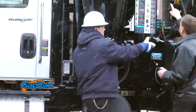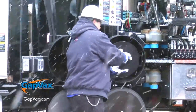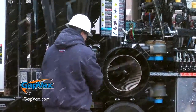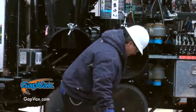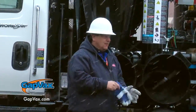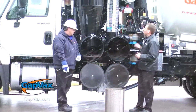The air then travels down through, and in here we have a stainless steel safety screen. The air has to pass through the stainless steel safety screen before it goes back through the blower. At the end of the day, when you're done vacuuming, pull the safety screen out and you can hose it down with the handgun located on the other side of the truck. The air passes through the safety screen, back through the blower, and out the exhaust silencer.